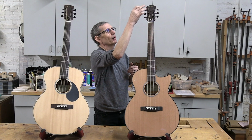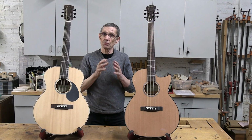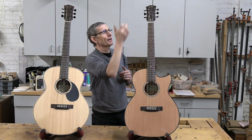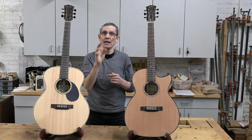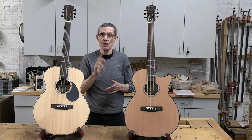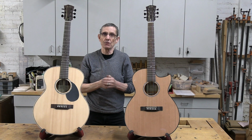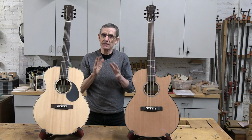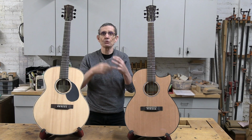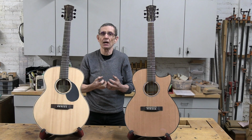This gets a lot of wear and poking around with string ends, and a gloss finish will start to scratch easily. So on all my guitars, I do a hand rub satin finish on the peg head, and we'll show you how to do that. But before we do that, I want to go back into the spray booth to the blackboard and explain a little bit about the physics and optics of how you produce a satin, semi-gloss, and a flat sheen on a guitar.